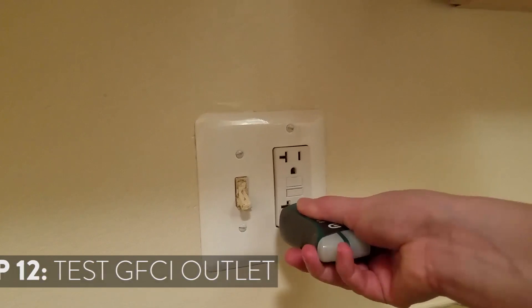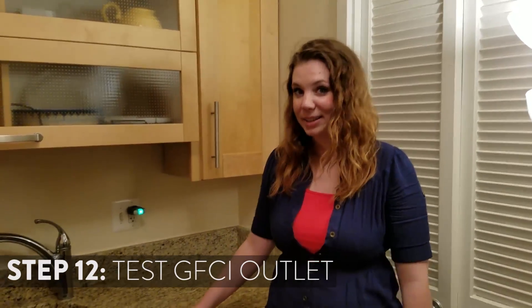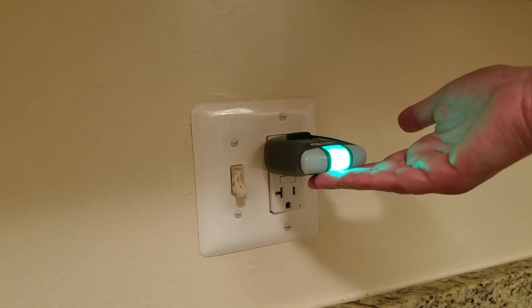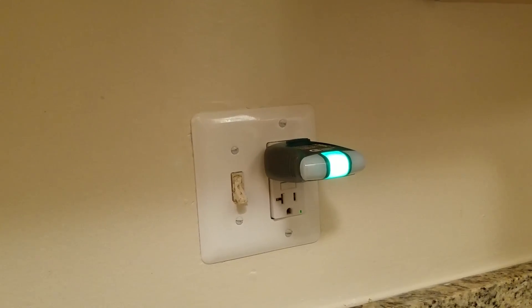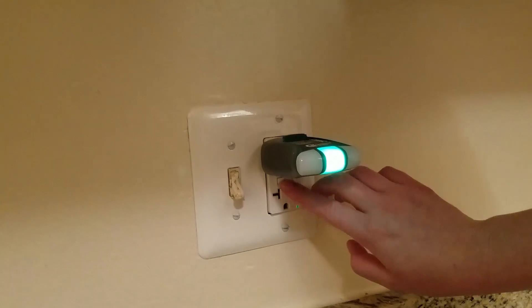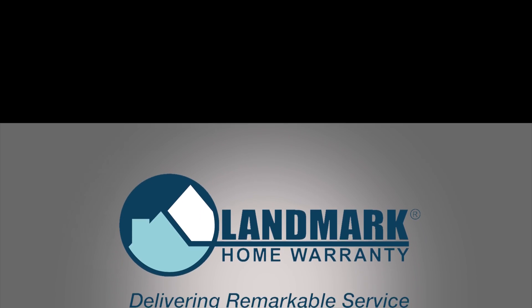To test it, plug in your outlet tester and go flip on the circuit breaker box. As you can see, your GFCI outlet should be working. Let's test this quickly to make sure that it's actually functioning as a GFCI outlet. Our outlet tester is showing that electrical current is indeed running through this outlet. To test to make sure that it is acting as a GFCI, you will just need to push the test button. You can see that electrical current has stopped flowing through this outlet. That's how to replace a normal outlet with a GFCI outlet.